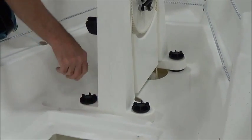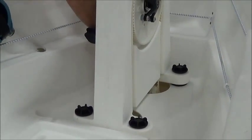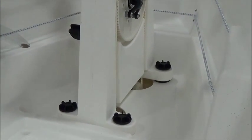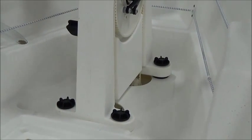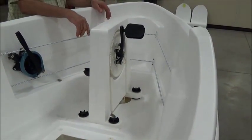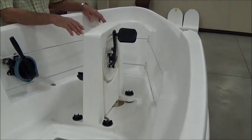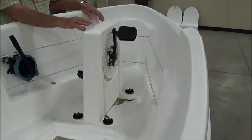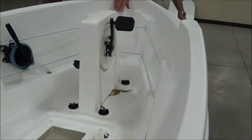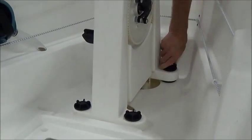It's important to tighten the screws up when you're going to check on this, because tightening does change the position very slightly. So it's always important to tighten those screws before you make your decision on which way you need to make the adjustment. I'm tightening those up and then we're going to go back and take a look to see how we came out.